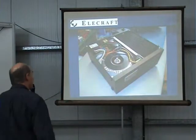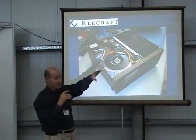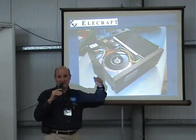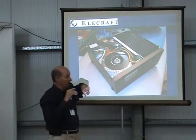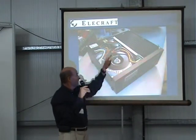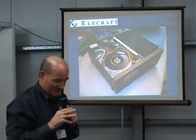And there's a picture of it. So there's the big guy. So basically it's very simple too. The RF deck on the right side is a sandwich of the PA deck, low pass filters, and heatsink. Even in the kit version, we've already tested that for you and burned it in at temperature, so it's gotten a big workout. And then the transformer, linear supply, and I/O back here in the back. And a front panel with the microprocessor that does all the thinking for us.